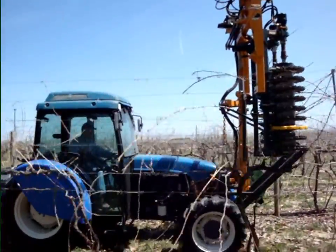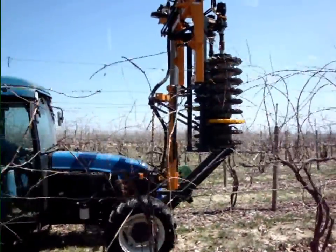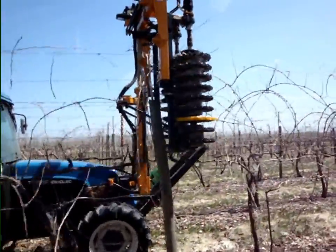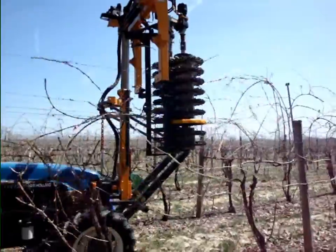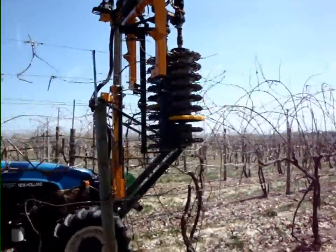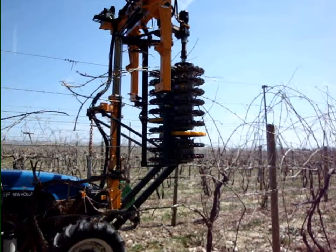Let's watch this machine in action going above the upper fruiting zone. If you look carefully, you can see that lower fruiting zone with canes already tied to a lower wire. Occasionally, some of the upper cordons have been replaced already with canes. If we hadn't done that before the pruning process, we'd have pruned them off with this machine and couldn't have done renewal of that upper cordon where it was needed.